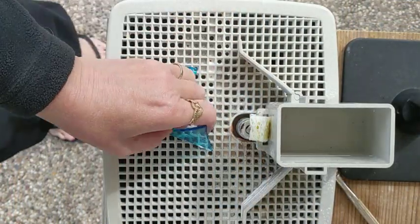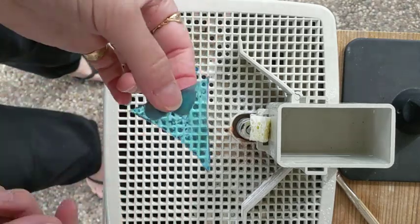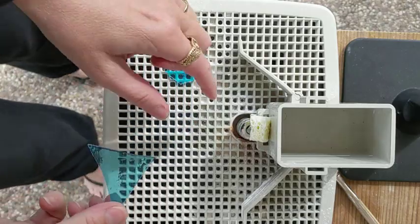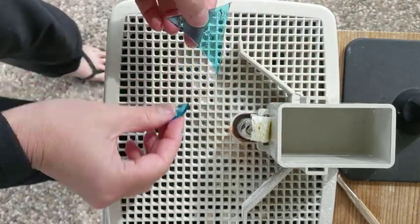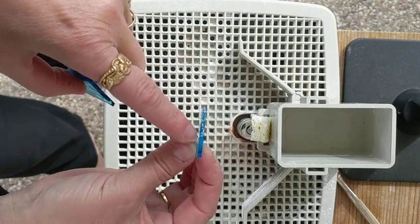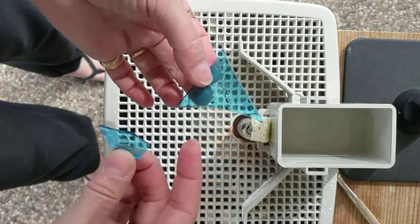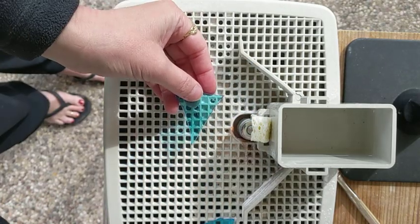A glass piece that's been cut by the method of scoring and breaking will have sharp edges. So as the next step, we'll actually have to go and grind these down using a water grinder. And this will also allow us to shape pieces. You can see some of the breaks kind of have hard edges, and we want to make sure they really conform to the shapes that we had in the cartoon.